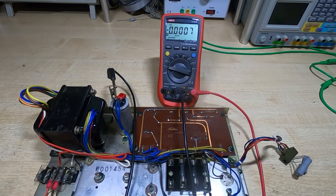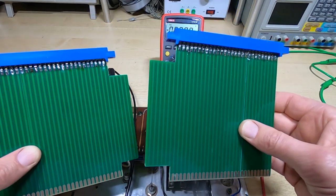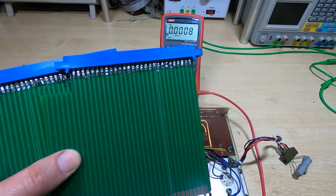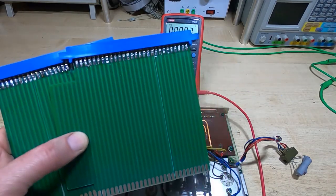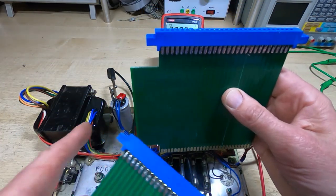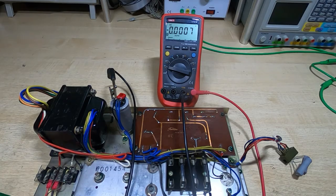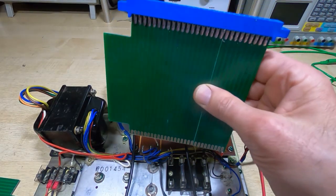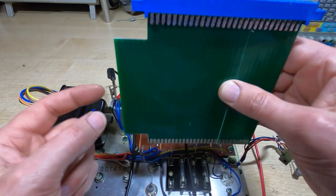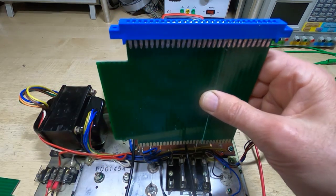So what I'll do in the next video, I've made up a couple of risers. These are to allow me to insert the boards into the backplane and have them elevated so we can work on them, have a look through each of these circuits and see that they're doing what they're supposed to, and try and figure out why this calculator is not working. The wings on the side of these are to extend into the guides. The type of connector that's used in this calculator is not very robust: if you waggle the boards about, you can splay open the contacts and then they won't make proper contact with the boards. So by having these wings we can make use of the guides in the main chassis and make sure that the boards don't rock about.